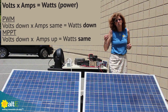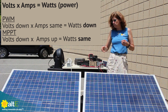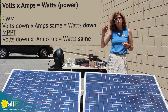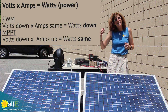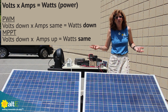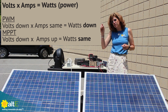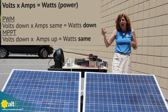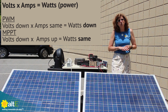Because watts, or power, equals volts times amps, if you drop the volts down to the right voltage for your battery bank, what's going to happen is if you use just a PWM charge controller, the volts are going to drop, the amps are going to stay the same, and so you're going to lose about half of the power. With an MPPT charge controller, it will drop the volts but raise the amps, so you're going to get more of that power from the solar panel to your battery.